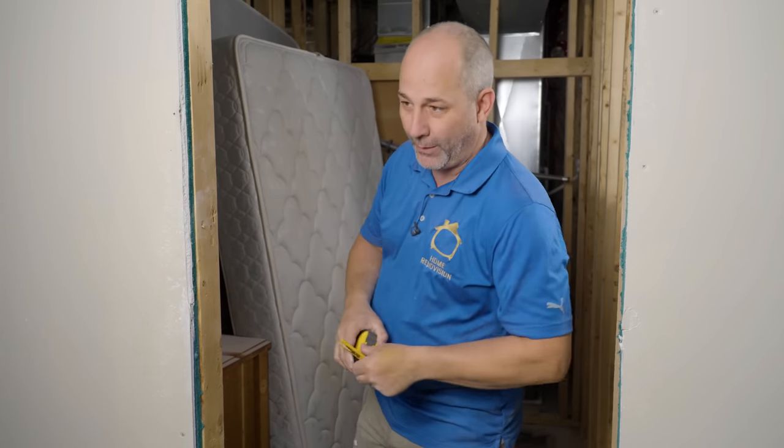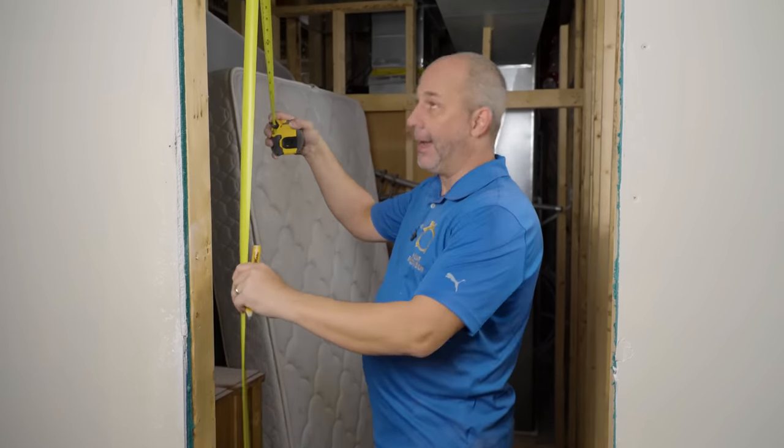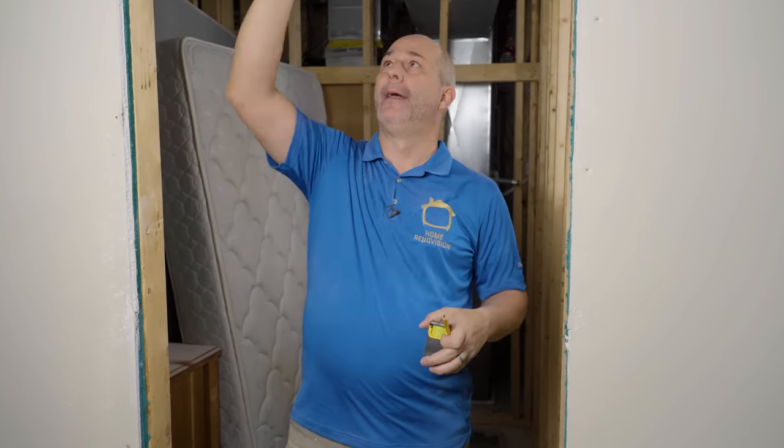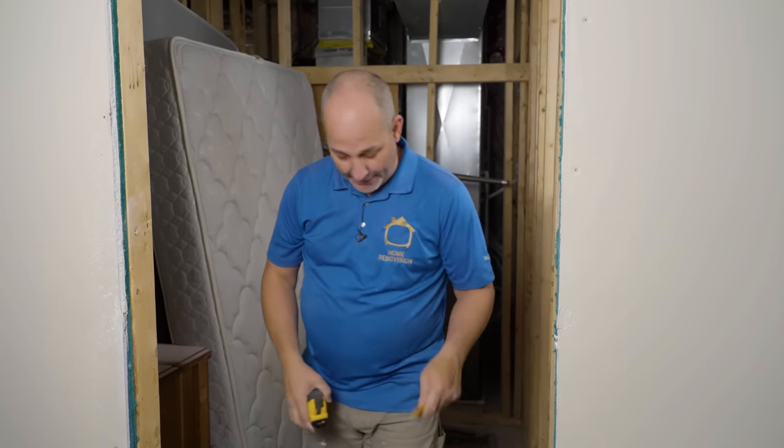What we have here is a standard frame. When I arrived, the framing was already done and they set up their framing at 83 inches. They did their whole two inches bigger than the door — that's all very standard. They gave us a little extra room on top, an inch and a half, because the door comes traditionally about 81 and a half inches door with a jam. What they didn't take into account is the fact that the homeowner was going to put in a subfloor system. So now I have subfloor system and hardwood flooring.